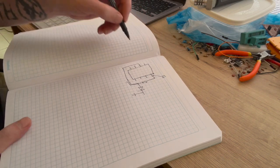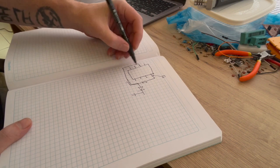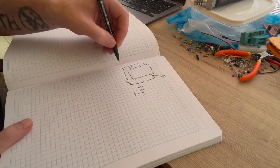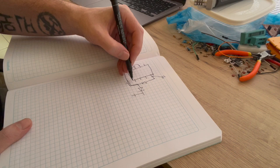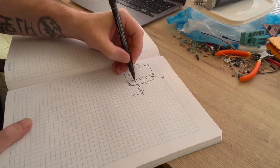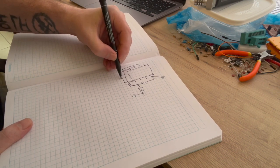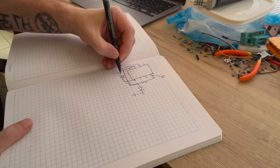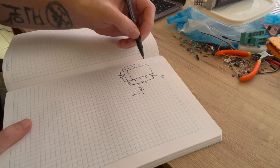And we don't do anything with pin 1. Now normally, we still have pin 3 to ground, and where before we had pin 4 doing nothing and pin 5 going to ground, now we are just taking pin 4 and pin 5 and connecting them with a diode. And this is showing a Zener diode, and like I said, I used a Schottky and it still worked fine, so I don't know.